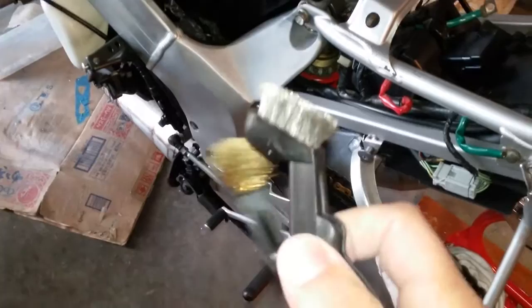You don't want to obviously use wire brushes on the more finished aluminum, but as you can see, this cast aluminum came out pretty nice. This was all pitted and black. Down in here where it's a little dirtier — I didn't do that area since you won't really see it — but it was pitted, black, and really grungy. So these wire brushes, using a nice circular motion — this is a steel brush, and I believe this other one was brass — they work really nice.